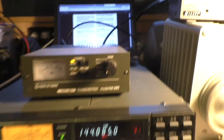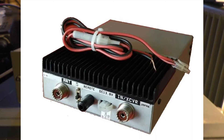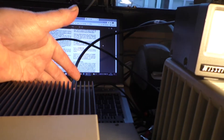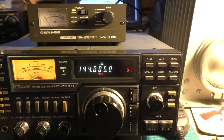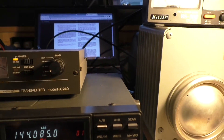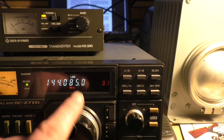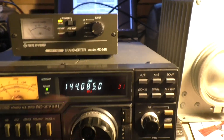I hope that helps if anybody's looking at buying one of these. Very simple to install — typical setup for any linear amplifier really. Output from the radio into the back, and then there's a socket on the back which goes off to your antenna. At the moment I've just got it running through an SWR meter and into a dummy load, but I've just plugged the aerial back in for a quick test. We're on 7 MHz, frequency 7.085, and it's as simple as that really — it works quite well.